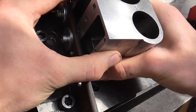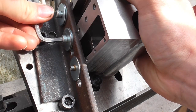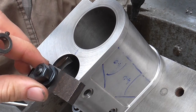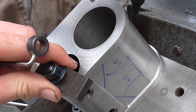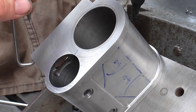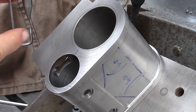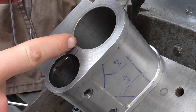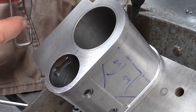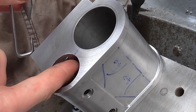Now I can put this on the angle plate with some M5 screws, make sure that's pulled up against a stop, and then nip all my screws up. Here is the stud I mentioned earlier — that's going to go down there and make sure everything's nice and solid. But before we do that I'm going to introduce you to the position predictor. This was shown to me by a friend called Richard Gibbon, and basically I'm going to use this in conjunction with those lines I've just scribed to check that the hole is going to appear where I expect it to. All I do with this is line the first crosshair up with this point and then slide this one up, and hopefully it'll line up with the inner crosshair.